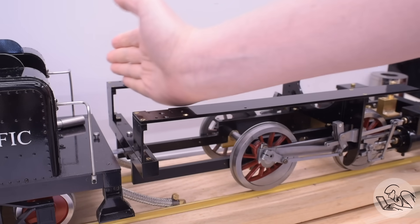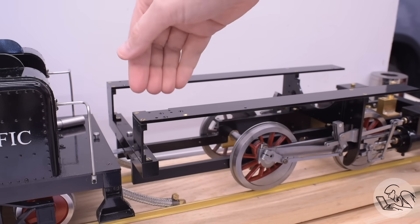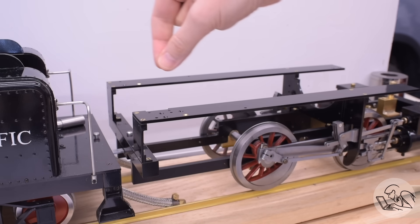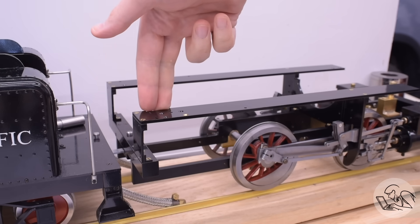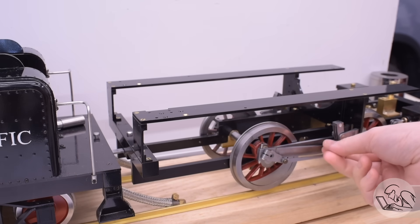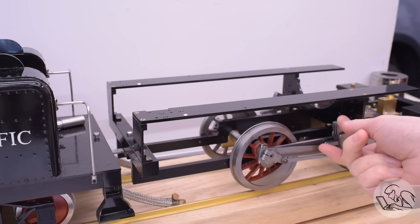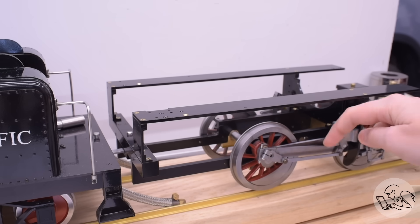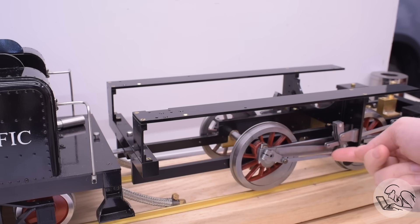Lending your imagination for a moment: the cab will be back here somewhere and inside that there will be a little lever right here that controls the valve gear. That lever rocks back and forth on a stand called the Quadrant. This fellow over here is the radius arm and that moves up and down to control valve hookup and switch into reverse. There will be a series of linkages which connect this radius arm back to the Quadrant and what's called the reversing lever that rides on the Quadrant.